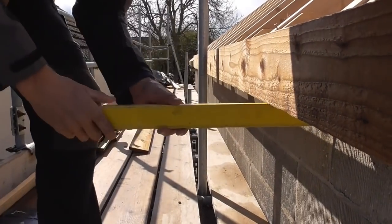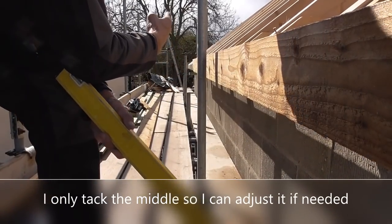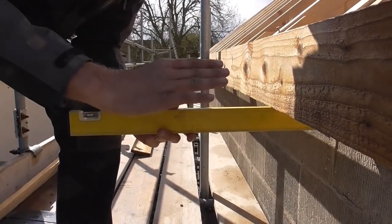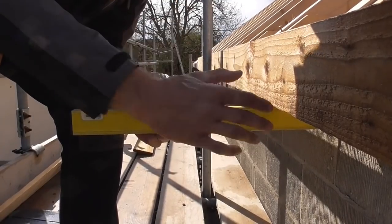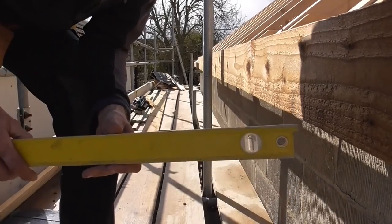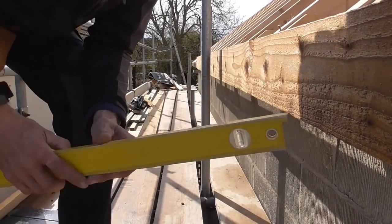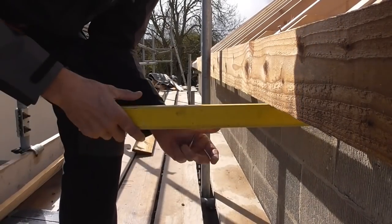Now what I'll do is the same in the middle, but this is quite a long run — I think this is about nine metres long here. So I won't do it all the way along relying on just the brickwork or blockwork, because that can sometimes have a slight sag in it if the line's not been pulled tight enough. So what I'll do is do it each end and then eye it through to make sure it's straight. I hope it's not the best video, but it gives you an idea of why a little modification to an old tool like that can make this really, really easy.